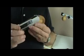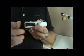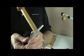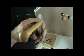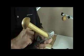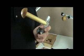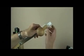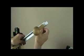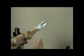This whole assembly has tremendous functionality, in the sense that we're controlling the yarn, we're controlling the brake, we're sliding this mechanism back and forth inside the extrusion. Where this dowel goes in, it's countersunk, so it will not allow the yarn to get trapped between the dowel and the extrusion or the plastic plate. So it has a whole bunch of functions there. Once you mount this sled, as we call it, inside the extrusion, it slides back and forth. And then you can tighten the brake. Now you can't move it.